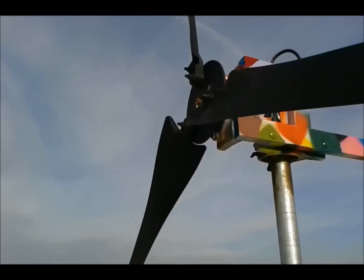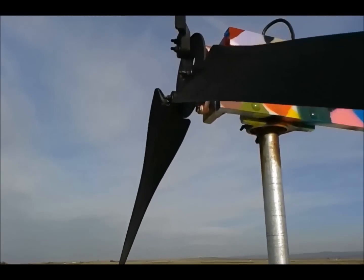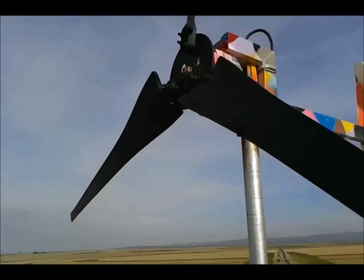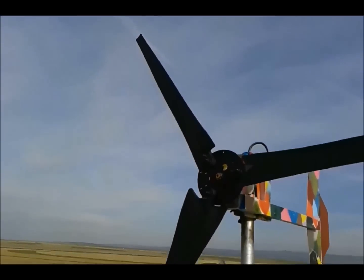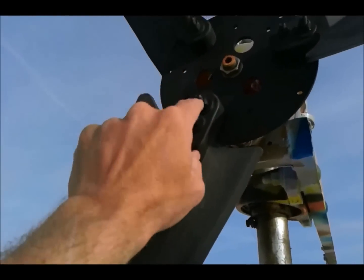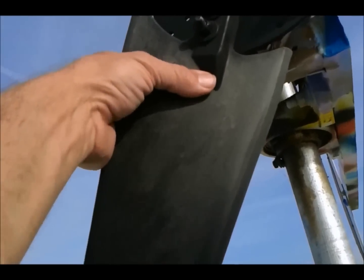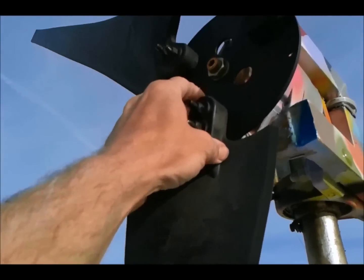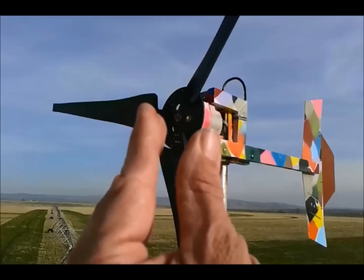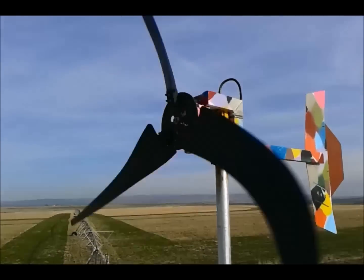There's no real cogging in this — this is a Thermodyne-based PMA so there's no real cogging. Very little — you can just feel it if you move them back and forth, but otherwise they just pretty much run on their own. There are the new KT blades from Thermodyne — that's the design. I took a nine-blade hub and drilled it. You can see how big the bolts are — these are a lot bigger bolts, a way thicker handle, and you see how far that travels down into the handle. This thing is just hunkish thick. It doesn't have much weight to it, and all the weight centers into the center. The way they built that airfoil in the back, the blades are strong, which I like.